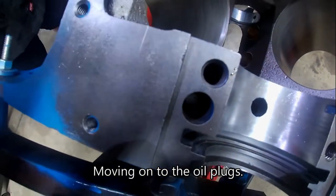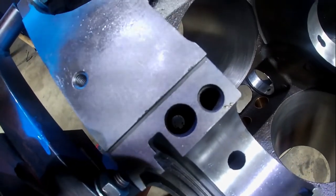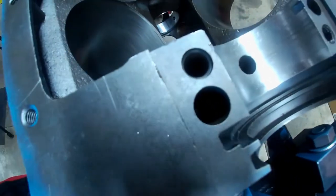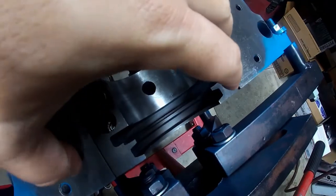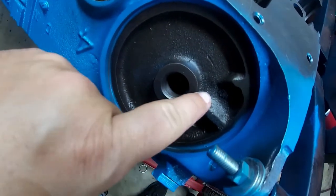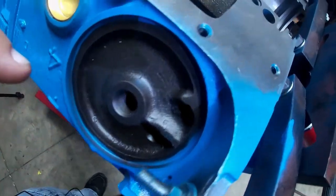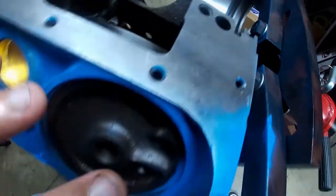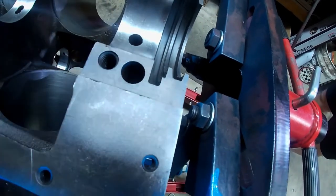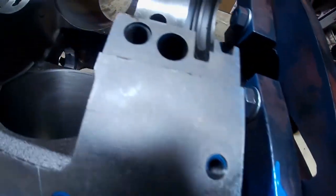Here's an interesting plug we put in. You can see there's a little plug up by the back of the engine itself. Why did we plug that up? This is the oil bypass. The pump is sitting right here, and what it does is it allows oil to come out the filter area, gets pressurized, and goes back through. It basically forces oil into that area. If that plug was not deep in there, it would simply bypass the filter itself and pressurize the rest of the system. We want the oil to go to the filter, so that's why we put that plug in.